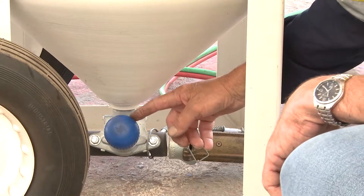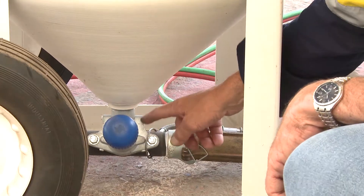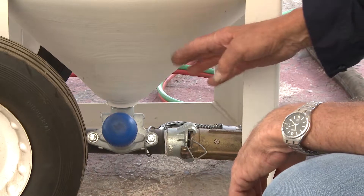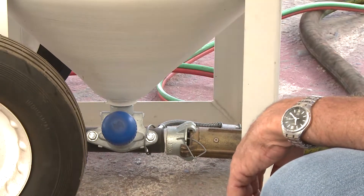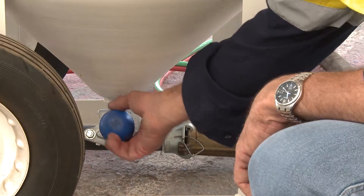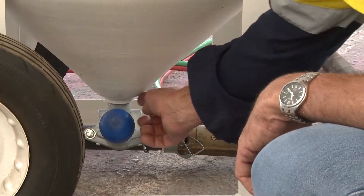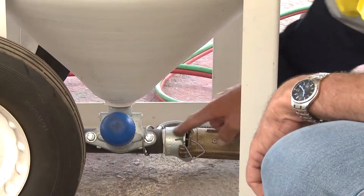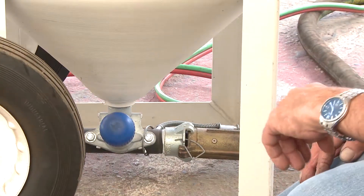This blue knob here is the end of the valve — it's called a micro valve. This system is the micro combo: that's the combo valve at the top and the micro valve down the bottom. What the micro valve does is, by adjusting that valve, it enables the flow of grit to enter into the pusher line and air line arrangement and into your blast hose.